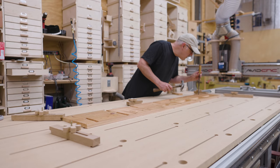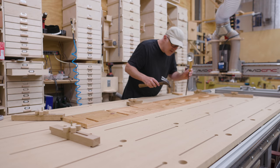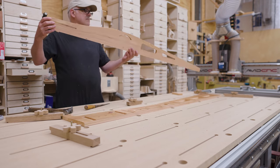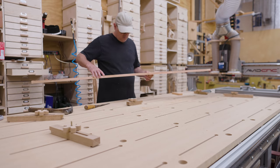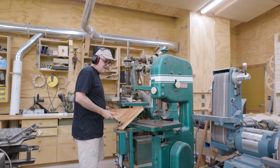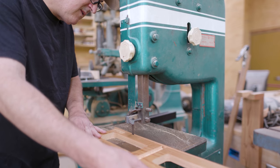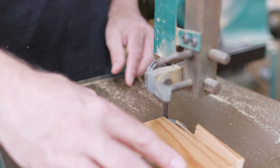I tried some different methods for holding the pieces in place as they were cut. Some I just cut completely free, which worked for the smaller stuff. For the main arms I used bridges to hold the piece in place as it's being cut out of the main piece of wood. Some pieces I didn't cut all the way through to the table, and I can finish cutting on the bandsaw — the idea being that you only have to cut deep enough for a guide bearing on the router table, and then you can flush trim the final bit by hand.